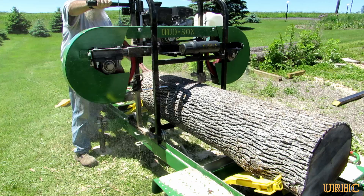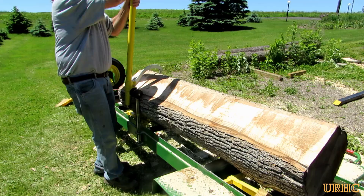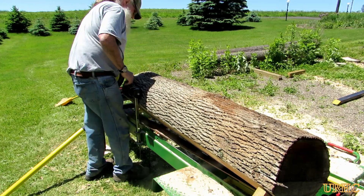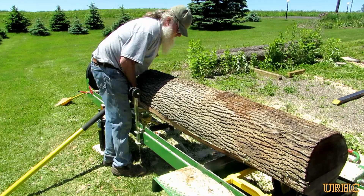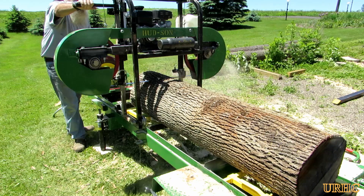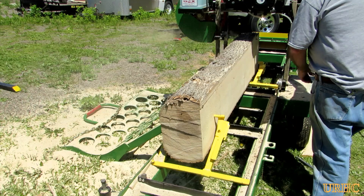You can see this log's a little bit smaller and the mill's having a little bit easier time with it also. It's a matter of just whittling it down and trying to get some flat sides on it. That log wrench is a really handy thing to have around a mill. Someday I'm going to get a shorter one, one of the little mill-special ones. It's really like having a couple extra people around to help you. I'm going to keep rotating it and cutting until I get a batch of inch-and-a-quarter thick boards this time.